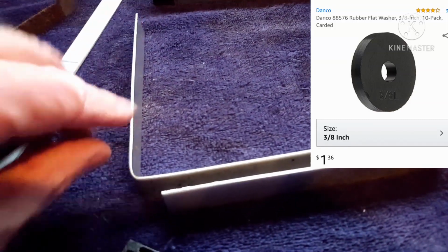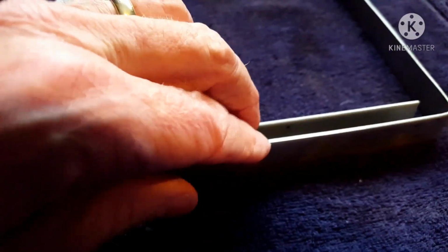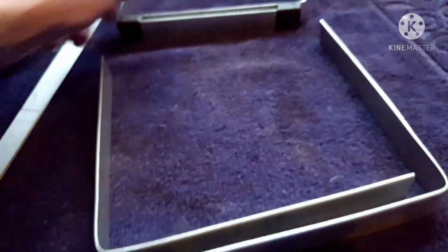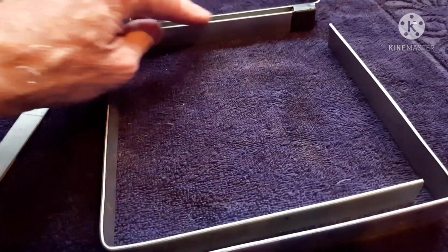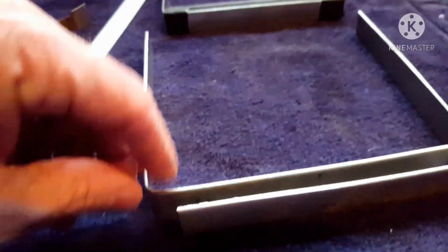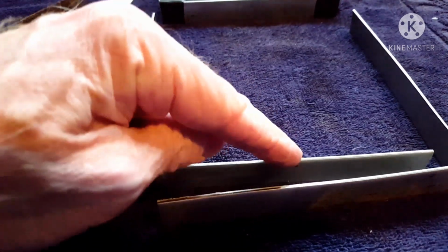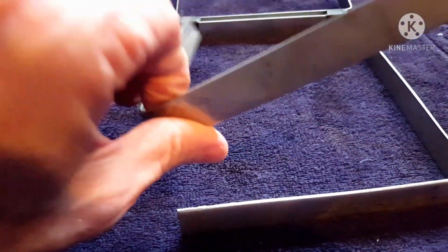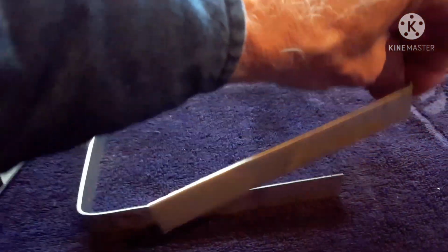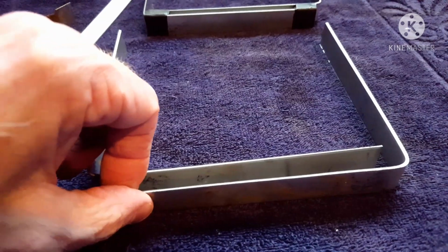And the design of this being symmetrical, 6 inches by 6 inches, is done for a reason. So you get double life off of it, because this is a sacrificial electrode. This will corrode completely. And so what you want to do is put the spacers between them and use it until they start to corrode on there. And once these get bad, about 1/4 of the way down, you separate them. You cut the black tape that you have there, and you invert these. This would be the corroded part, and you would turn it like this, so the corroded part would be up. And you take that one, the corroded part is here, so you would turn that the other way, so that the corroded part would then be up.